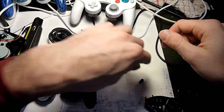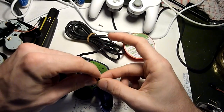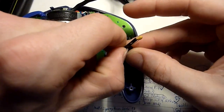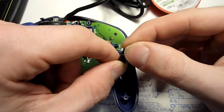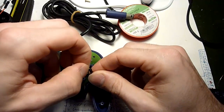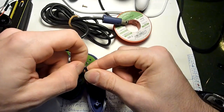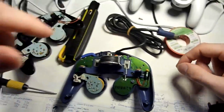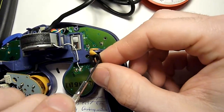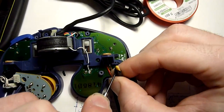And another important thing is that these wires, that I will link in the video description together with the capacitors for the cheapest deal I know on AliExpress, have these small spots here with the holes where you can see the metal holders inside. Maybe at a certain angle you will be able to see this on the camera. And sometimes they are a bit loose, and you get the feeling that just from shaking the controller, the capacitor might slide out of its female wires. And luckily, with access to these pins here, we can just use a small flathead screwdriver to push these pins in to make the connection tighter and more lasting, so that they certainly won't fall out.